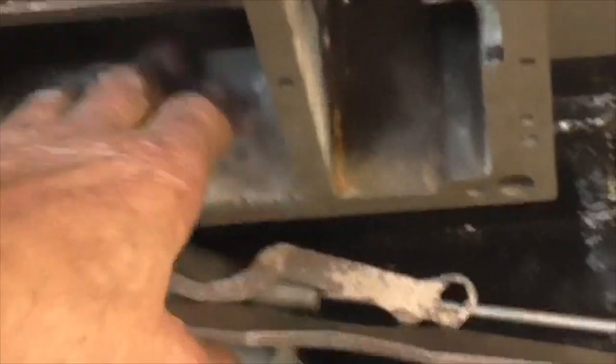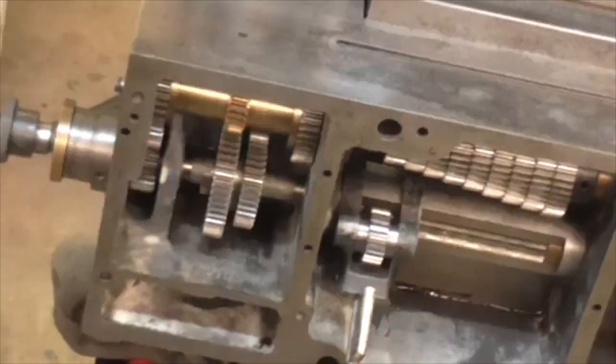I don't really think there's enough there to warrant doing anything with it. I might just fill the striations in the back to increase the contact in the back of the saddle. I might not even bother doing that. That's it for Monday - I've cracked on really well today. I may have to take it all off again tomorrow, but I've put shellac-type gasket cement on the back of that - it's only four screws and two screws to remove.